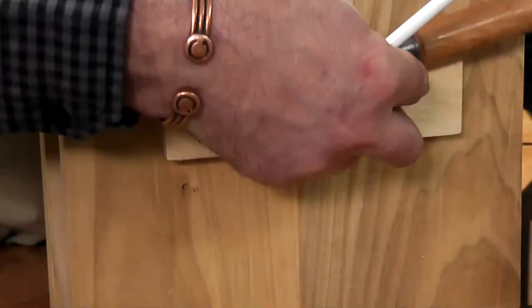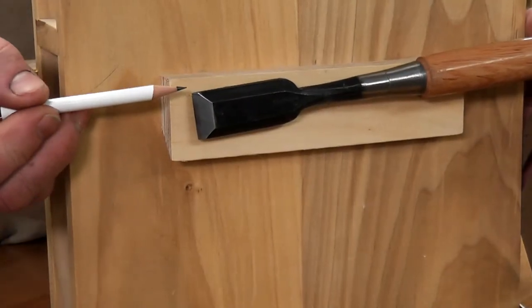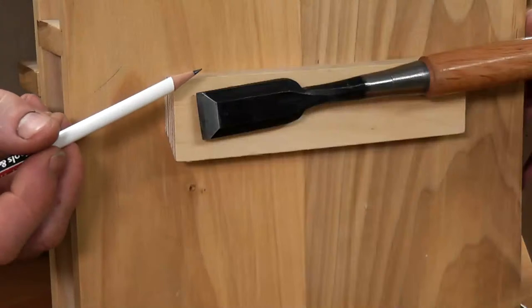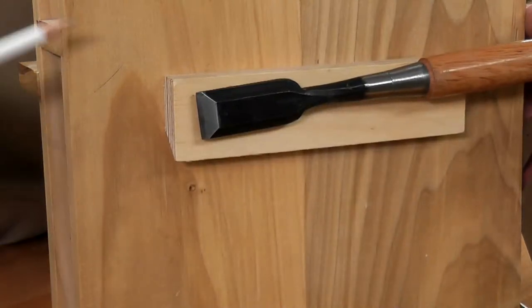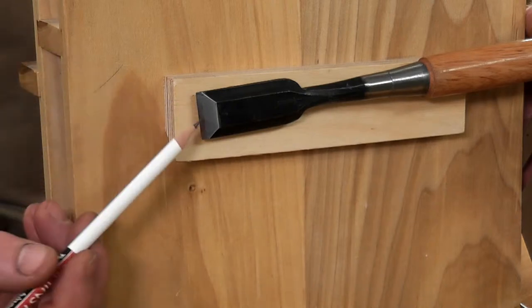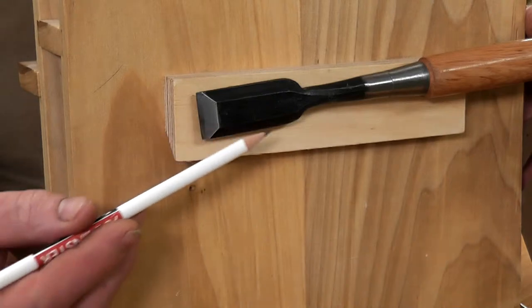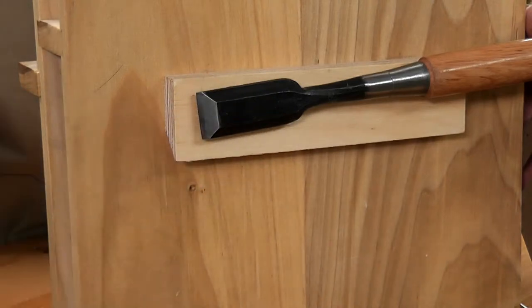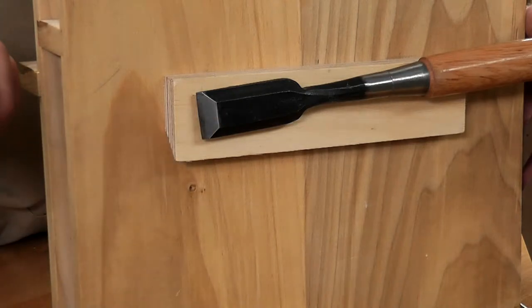Okay. All right. Now, on this chisel, I'm hoping you might be able to see it, especially the guys on your screens at home. They have a laminated blade. That's the first thing that makes this so different. One here on the tip, you get a shiny bit. Yeah, okay, polished it. But there's a dull material on top. So there's two different steels in this blade section. That's quite amazing. So there's a laminated bit here, another bit of metal on the back.